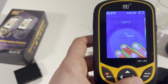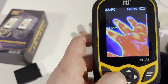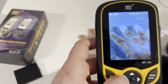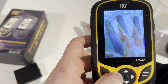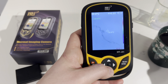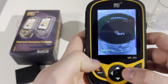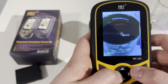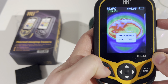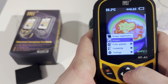The camera will start out in its image view. You have a four-way adjustment that allows you to overlay thermal imaging. Let's move in a cup of coffee — this is now imaging only in thermal with no underlay. The temperature on the coffee is about 65 degrees. We'll move the coffee out of the way and bring in a cup with an ice cube. You can see the ice cube is at minus 12 and the counter is still warm, radiating from the cup.